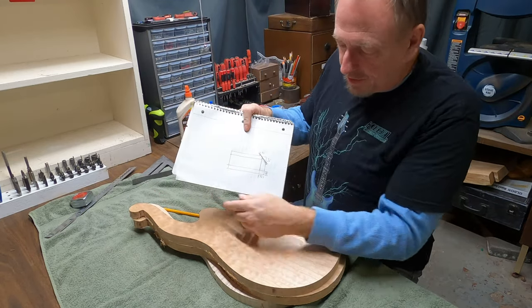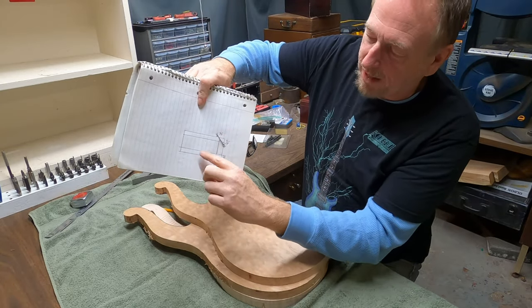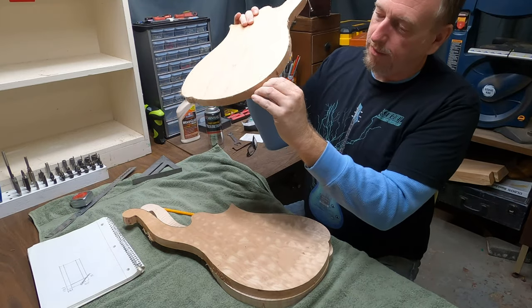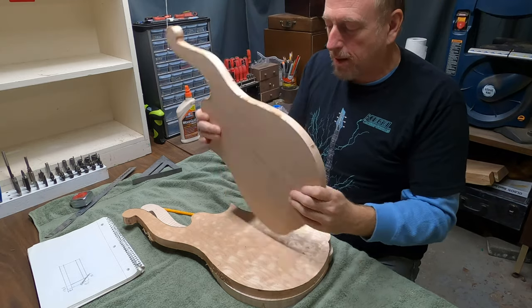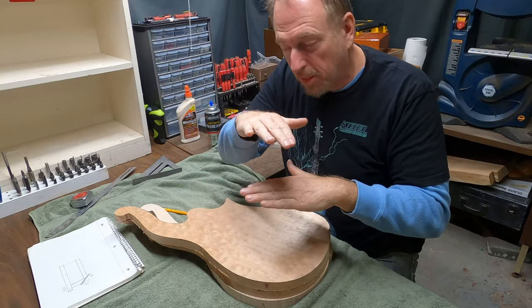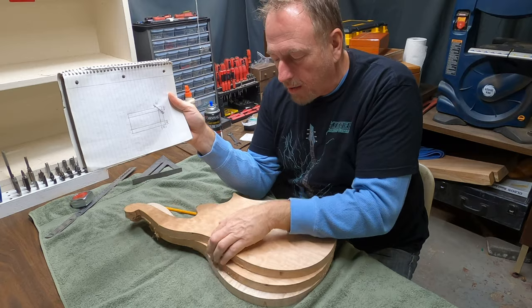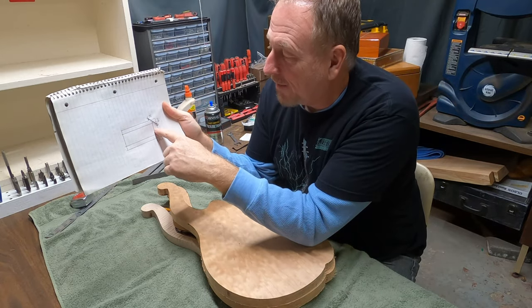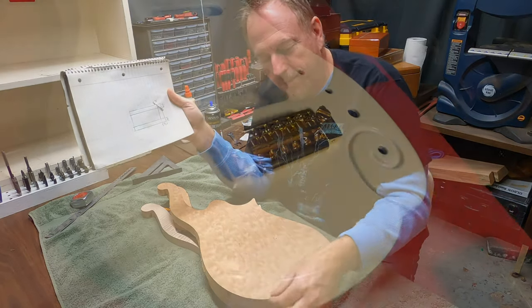I've done a cross-section. If this were the cross-section of this guitar body here, I've got a quarter of an inch, so I'm going to be routing down and leaving a quarter of an inch down below on each of these bodies on the inside. There will be a quarter inch on the outside portion of the top and the bottom. The narrowest point of these side walls is a half an inch. And then we will be routing off a corner